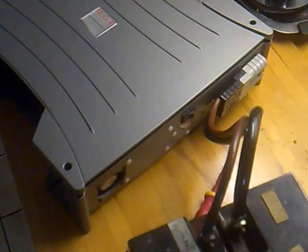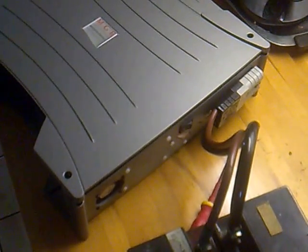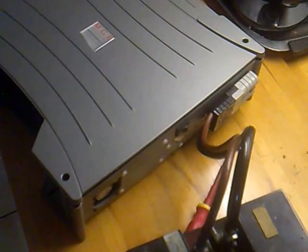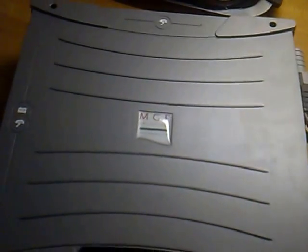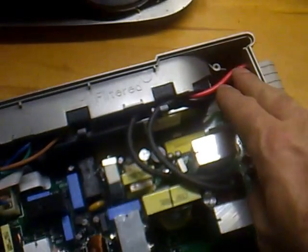You may notice I've also added a few things. Computer UPSs tend to only have a relatively short run time before the router shuts down and the server shuts down, so they don't tend to need a huge amount of cooling compared to a normal inverter. So I added some cooling and I'm going to modify this casing here with some ventilation holes over the heat sinks. Inverters cannot always be placed in handy locations, so I've modified this one to make it a bit more handy. I've left this space for the batteries intact. The wires here I've run throughout into the plug — they can always be run back at some stage if I want to put it back to the way it was. And these big shiny silver things, which you're not going to touch because they might be charged, are the actual heat sinks of the drivers.